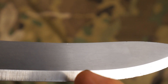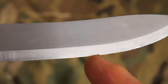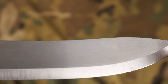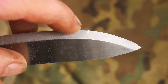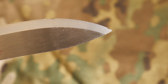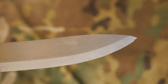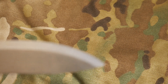The first little chip was just there, and that one was caused on the leg bone of the pheasant — it's a very symmetrical circular chip, which indicates the structure of the steel is very uniform. There's a roll there. The biggest damage was done to the tip — quite a chunk taken out there. The blade is showing that in places it's rolled and in other places it's chipped. Quite possibly the chips happened after there was a roll, so the roll would have weakened the steel to start with.